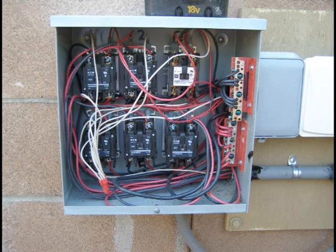Five: the bus bars are not labeled as hot or live. Six: the bus bars are fed by two pieces of number 10 wire, not visible in this photo. Seven: the bus bars are fed by number 10 wire that is in turn fed by a 60 amp breaker in the power supply box to the right, also not visible.